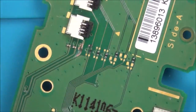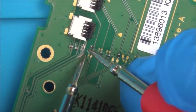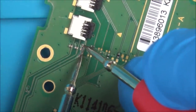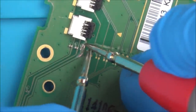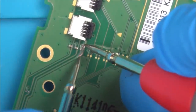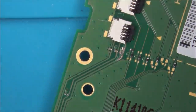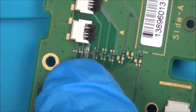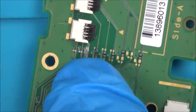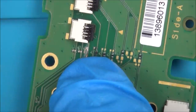Right, so that's where the path has gone, you see. So what I need to do is put a tiny bit of wire to jumper that. I'm not going to worry about that capacitor just yet because I think that's just to filter out a little bit. Can you see there? There's nothing happening. So look, we've got continuity there and we've got it here, there, but not between there and there. Let's join up that. And then if it's all working, maybe, I mean, I'm not going to have capacitors. I'm sure I haven't got them that small. Can't remember now what the smallest size is, but I think it would work without that. I think that's just to clean it up a little bit.